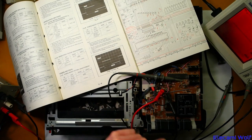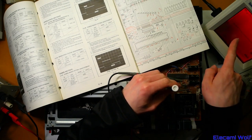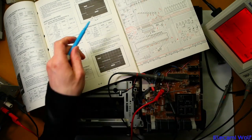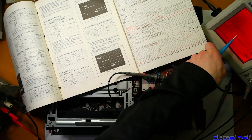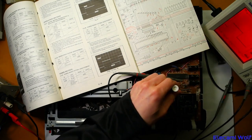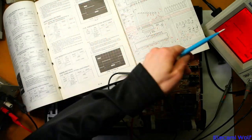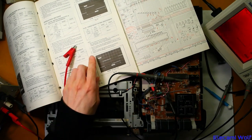I think I've worked out what you're actually supposed to do with this now. You're supposed to adjust it so that the signal drops from where it's a very long duty cycle, to the exact point that it drops to a higher frequency — which is the last thing, 7.8 milliseconds. So we've done that one. That is adjusted. So we can do the next one, which must be done after the first one. Set the voltage on the power supply to 4.4 volts this time. Connect the power supply, and it says connect the jumper to 5.0. And now we're adjusting this one up here — 62 milliseconds. Alright, so we've done that adjustment.